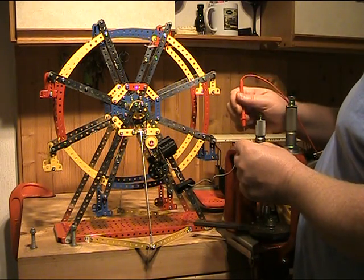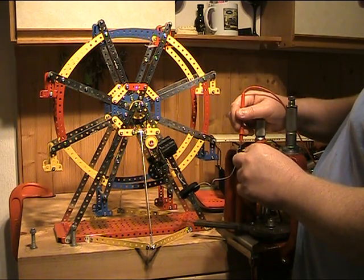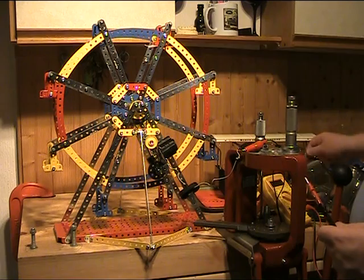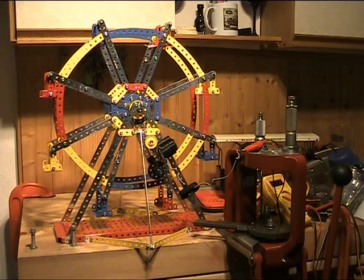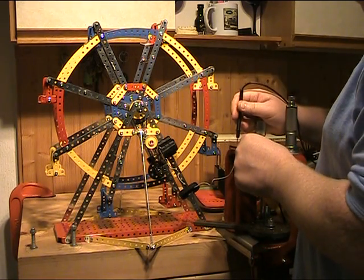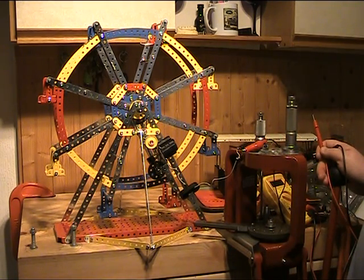Just check, see what it's coming to a bit. It's just getting up to a decent amount of steam. And at there I'm getting 0.66 of a volt. I'm just going to let it build up a bit. It may be that that's the fastest it will go with it connected. So we'll see. Going well now. We'll check the volts here. 1.2. I really need about 1.25, 1.3 to make a go of it, I think.